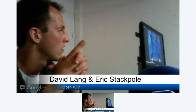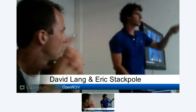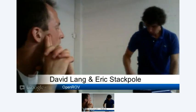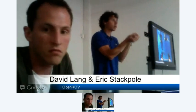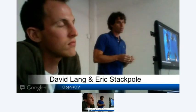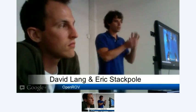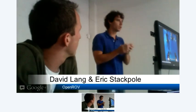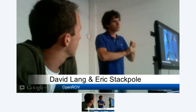I think eventually you're going to... I disagree. It's interesting. It's a good discussion to have. There's this chart I've made that I haven't put up on the internet yet, but fiber optic is something we looked at a lot. I think the points you have here are really good. I imagine you're thinking it's close to neutrally buoyant, it's very thin, and it can handle high bandwidth. But the problem is that if we want to continue to make this low cost, and you have to adapt fiber optic to something a normal computer can understand, like Ethernet or USB, it's very challenging. And if fiber breaks, it's very hard to re-terminate.